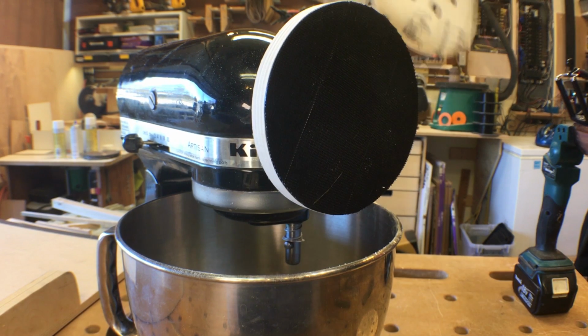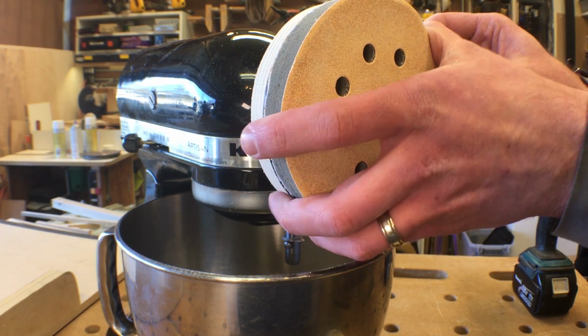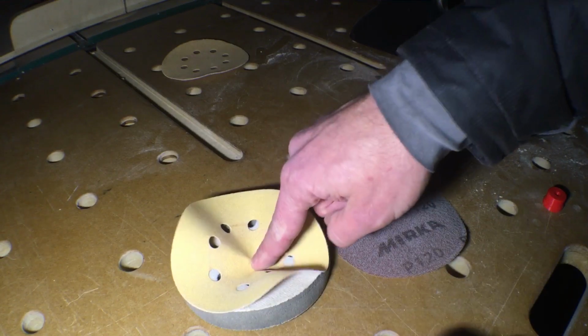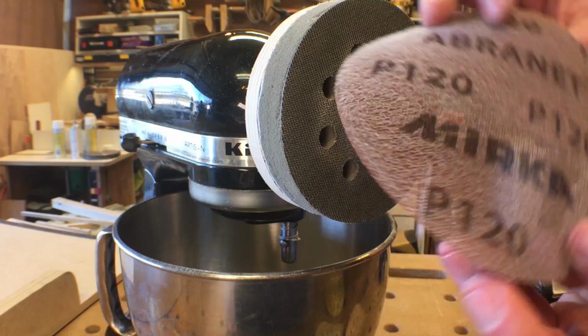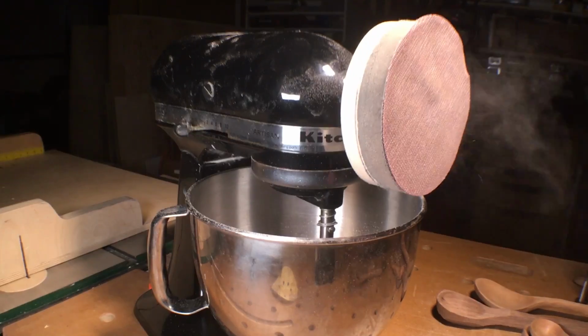Now I'm switching to a foam squishy interface pad, which takes us to another level. It allows the sandpaper to morph around convex surfaces. And I'm also switching from a paper-backed sandpaper to a mesh-backed Abranet sandpaper. I'll put a link in the description so you can read more about that. It's just really flexible, which is great for this.